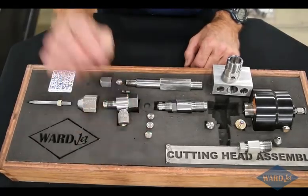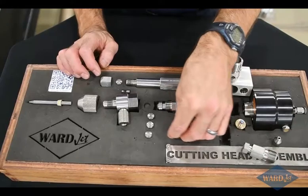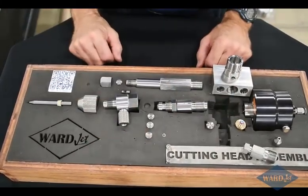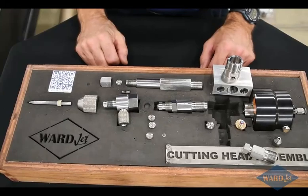And then the diamonds are nice because they are guaranteed for at least 600 hours if you do have that final filter installed. And the nice thing about that is, of course, you can just put it in and not have to worry about it for several months at a time. Whereas your ruby and sapphire, they can be anywhere from 0 to 40 hours.